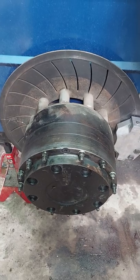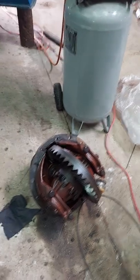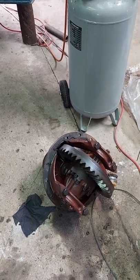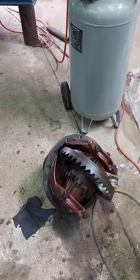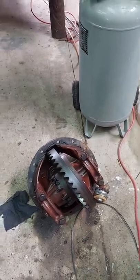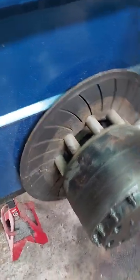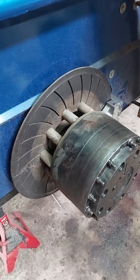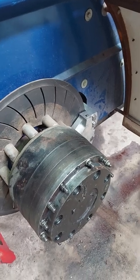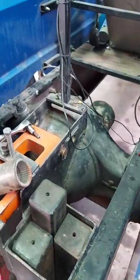I've taken these all apart. We've changed out the gearing — there's the old set of gears there. They do these rear ends just like they do on the pulling tractors. They needle cross the rear ends, or the shafts inside the rear ends, but one thing they don't do is put the brass washers in the sides because they will one-wheel too easy. We've run into some issues with this rear end. I know the pullers will listen to this and say 'we knew all that,' but these videos are more informational for people that don't quite understand what all goes into these.